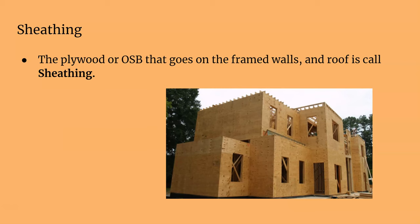Once you have all your framing done — the bones of the house — you have to cover it all with sheathing. At that point you can move your braces, because the sheathing holds all your walls together, connects everything, and locks everything together.